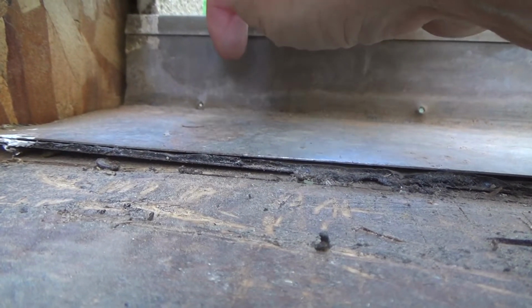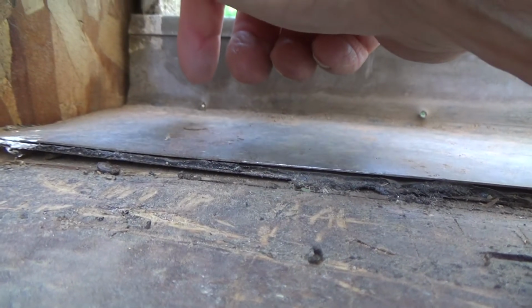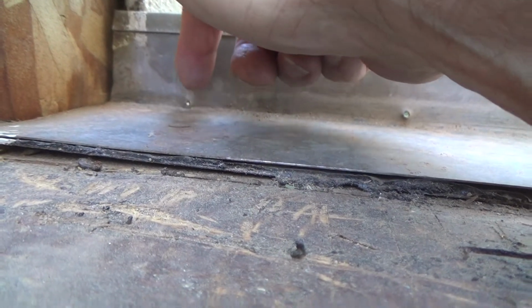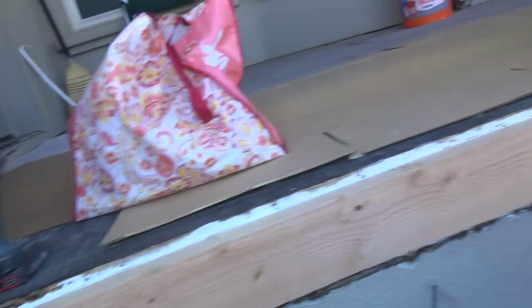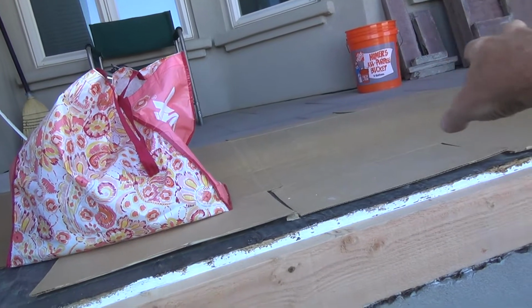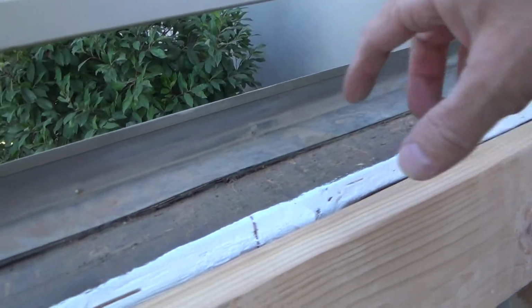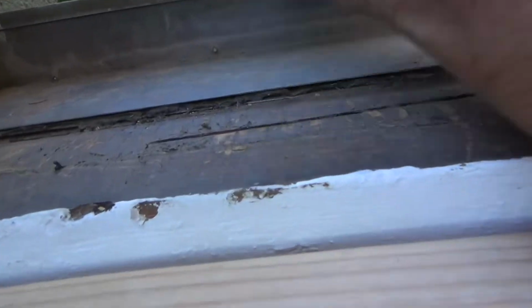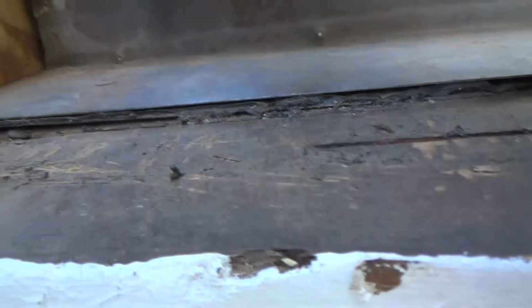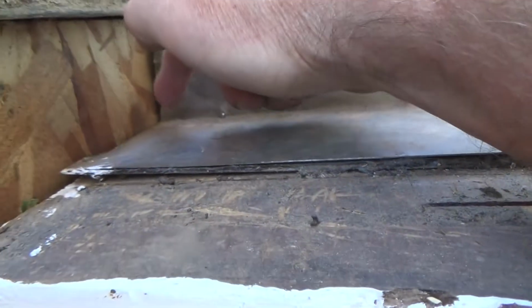It's just a pinhole. And when they put that sand in here, they could have had some sand granules in the way. After they put the tiles down, they put some very fine sand into the joints and stuff, and on this outside edge they did the same thing. And so sand went down in there because I had to sweep it all out, I remember. So see, if that was covered up, guess where the water sat? Yeah, it went over to this edge.